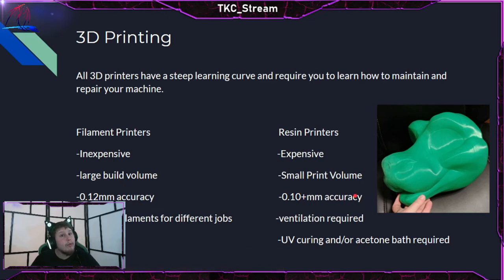And they're also a lot easier to sand. You can also sandblast them a lot easier. If you sandblast a filament printer, you might actually erode the plastic itself, burning a hole in it, because in a lot of cases you essentially use heat to sandblast, or because it's friction-based and friction generates heat. But these are a little bit more heat resistant. As such, sandblasting and regular sanding or wet sanding yields better results in creating a much smoother final version.